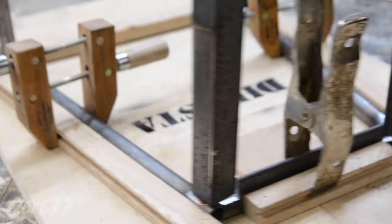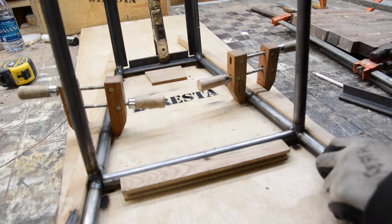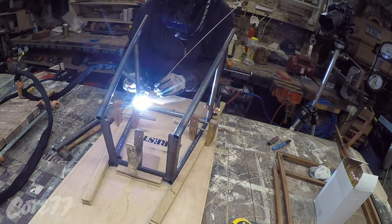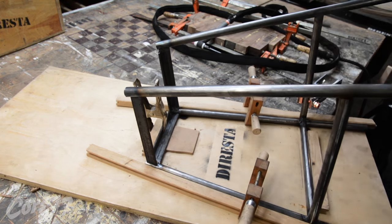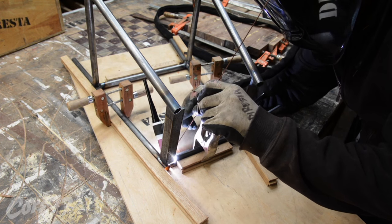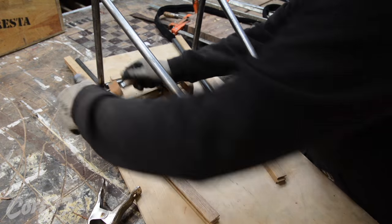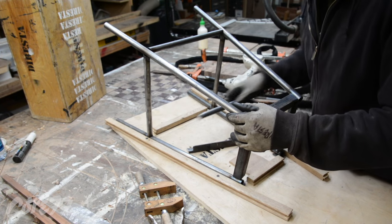Now that I have the two sides, I've got to connect them together. I needed to notch out that piece of angle iron — I'll need to notch that there and also on the opposite side. And here I am using the silicone bronze for this joint. I know that I'm going to grind and file my joints — the ones that you can see. At the top there I'm welding inside, so no one's going to see that. There's just going to be a butt joint available to view on the outside. And then my jig just caught fire — just blow that out. So now I have three sides done, and now I'm going to go for the fourth side.